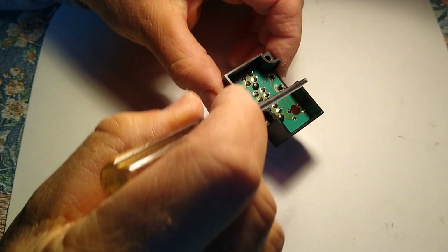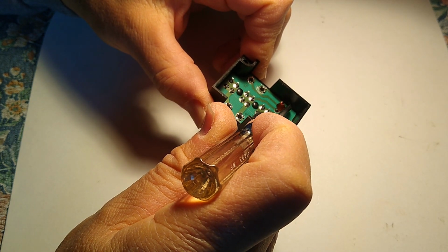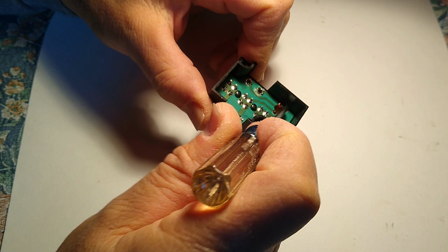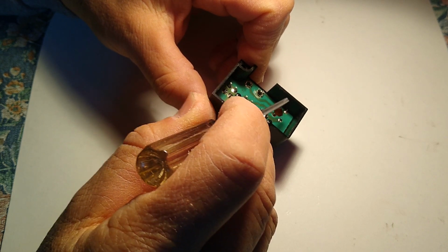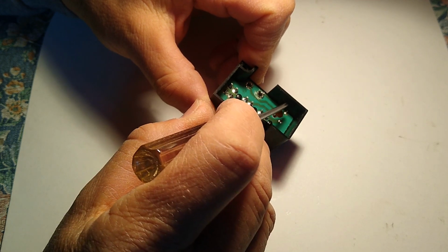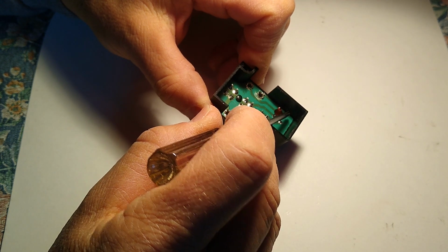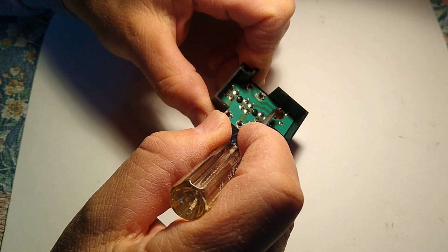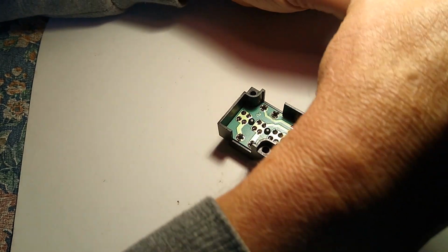And what we found in doing that is on these two pins, the pins are somewhat by themselves, meaning they're cracked. Where the pin comes through the joint, it is fractured around the pin. And even though there is continuity between these two given areas at times, it normally takes a slight amount of effort being pushed against either one of these central pins to get continuity to where the circuit board shows that it leads. And we'll test that by turning on our meter for continuity and sound.